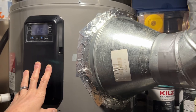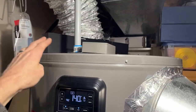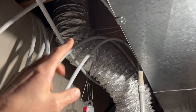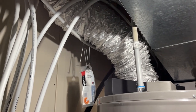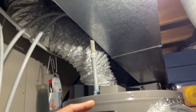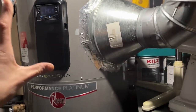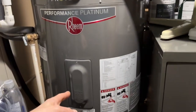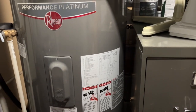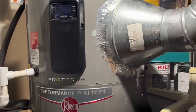Cleaning your filter is critical — make sure you do that, you will notice a difference in how it operates. I pull air from upstairs rather than just from the room. I cut a 10-by-7 hole in my wall with an air return to pull from the upper hallway, where we get 24 to 26 degree Celsius air when the wood stove is running versus 14-16 degrees in the basement — that's 10 more degrees of warmer air. That's probably why my system works well. The electric elements use a lot of power — 5,000 to 5,500 watts, and with the compressor in high demand mode it can pull 5,700 watts for an hour.